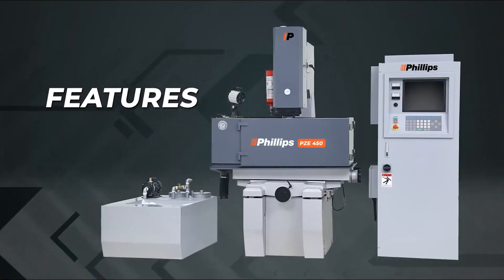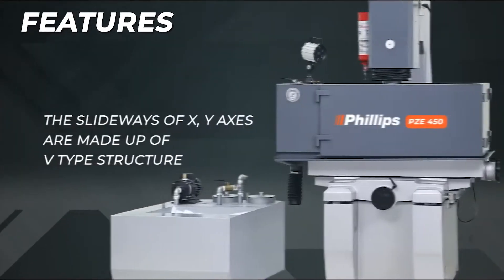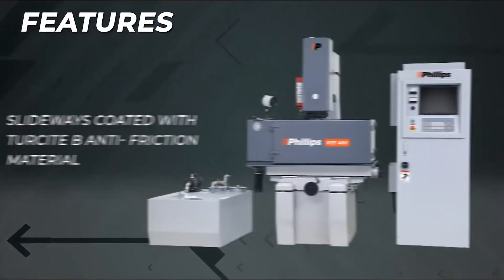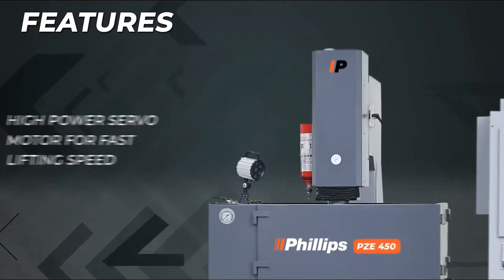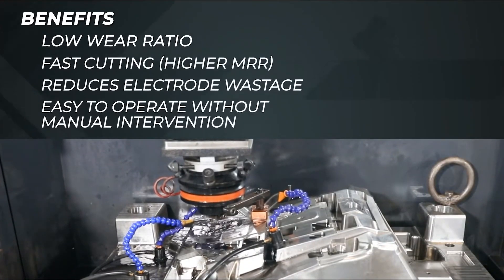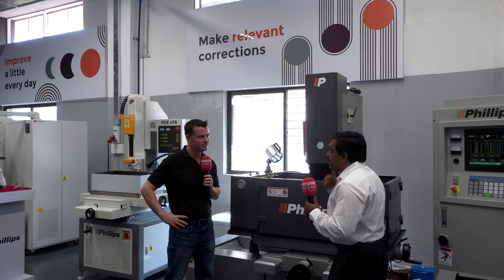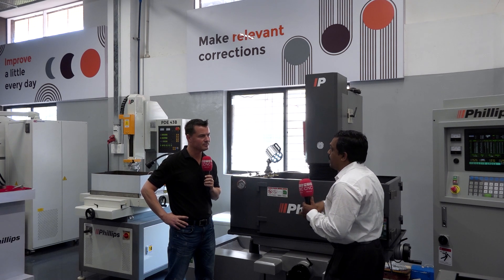The process handles different types of electrodes, like small thin rib electrodes. It can work without arcing. The technology itself controls how much current has to be applied to a particular zone to burn out the material, whether medium or faster, depending on carbon flush-out — it controls all those parameters internally. Moving on, the surface finish you get after machining is as good as polishing, so whatever time would be required for secondary finishing operations will not be needed with this machine, because the product will be finished to that standard.